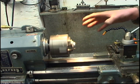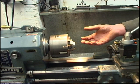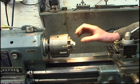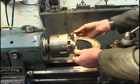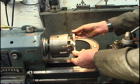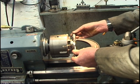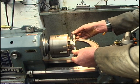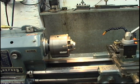What I'll do, I'll try and get this side the right size. If I go under, it means I can use that as a trial gauge for the underside, so I can turn it round and do the other side. Thou and a half too big.